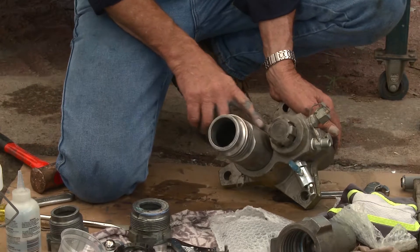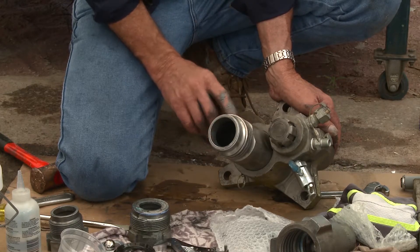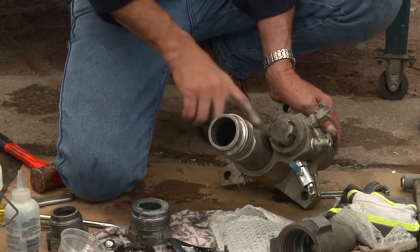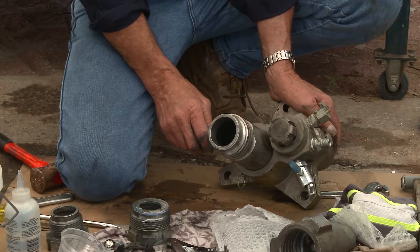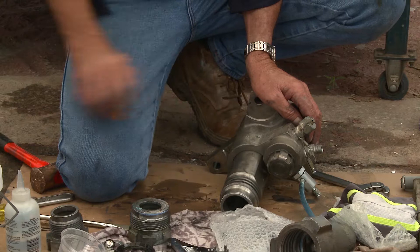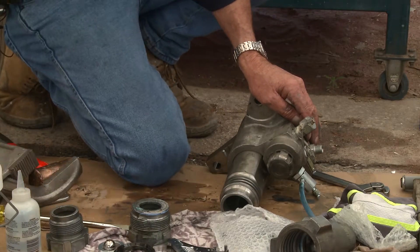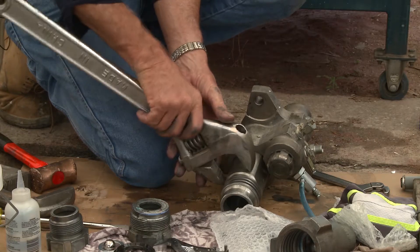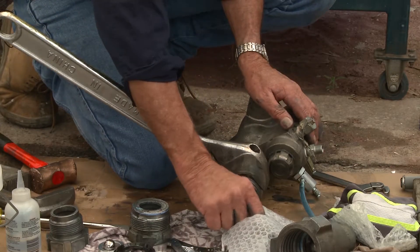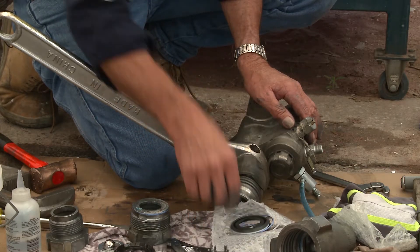If you're on site, the chances of getting the cylinder out of the cast housing are quite remote because it's very tight. The only time you'll need to remove it is if there's scouring in the cylinder. From a common sense and proper repair perspective, yes it does need to come out, and I'll show you why. To remove this you'll need a substantial pair of Stilsons or a large shifter to get onto the castellation of this cylinder. Behind the cylinder there's another O-ring — it's quite a substantial one and easy to identify in the packing kit because it has a thick wall. That thick-wall O-ring goes at the top of the cylinder.